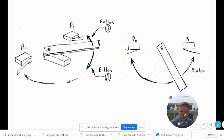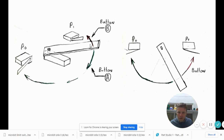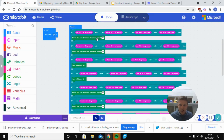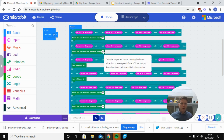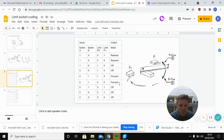The switch is set up with both a 2D and 3D diagram, so you can see it from the top. The platform rotates hitting one limit switch, and when you press button B it goes back. Button A moves towards P0 and button B moves back towards the other direction. I'll show you the actual code, but first we need to understand what's going on. I found it easiest to draw a diagram on paper - you need to program what's happening at every state your device is in.